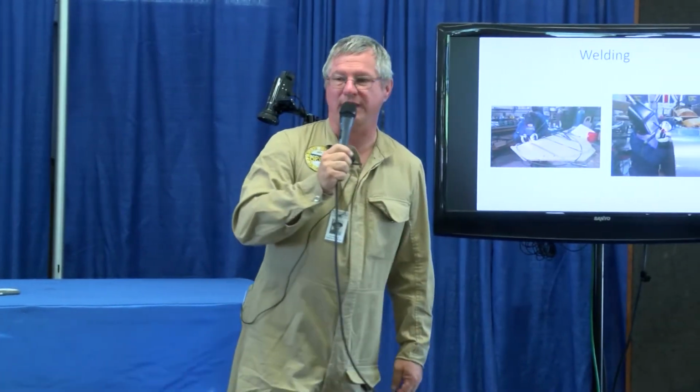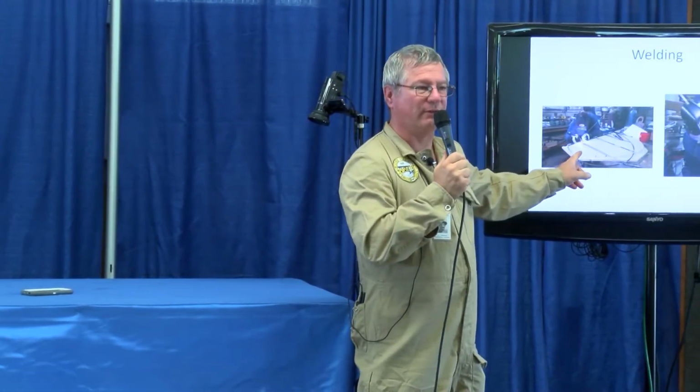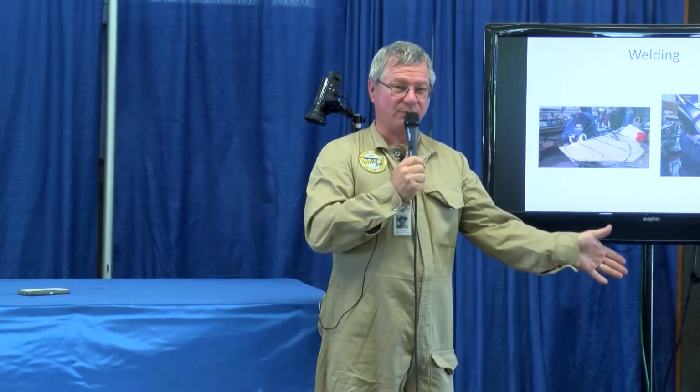There's all sorts of places where you get steel tubing that's preformed to shapes very similar to early aircraft. The problem is the early aircraft shapes require bending, and most of those shapes are made out of 4130 moly steel tubing. So if you ever try to bend a preformed shape, you find it very, very difficult, and it will tend to crack when you try to form it. They didn't do it that way when it was originally manufactured. They would take a round piece of tubing and bend it around a frame. In this case, we would bend it around a form or a jig that we've made, and then they run it through the rollers after they have the correct shape. So the streamline profile is actually put on after the shape of the fin or the shape of the part is needed.